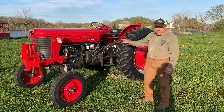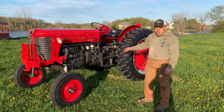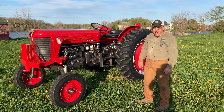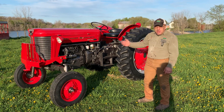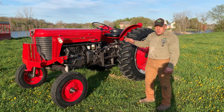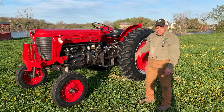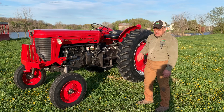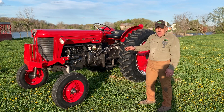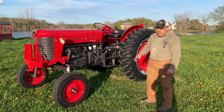The motor — we got the Perkins diesel, so the motor was all rebuilt. She had a loader on, so obviously the tie rod ends and stuff were a little on the rougher side. The power steering pump was shot and had to be replaced. The radiator was totally gone, the core had to be replaced. The power steering cylinder was frozen and not working properly, so we had to have that all rebuilt.